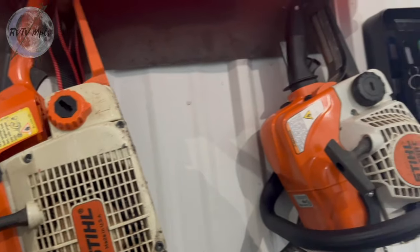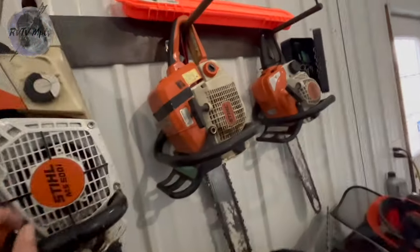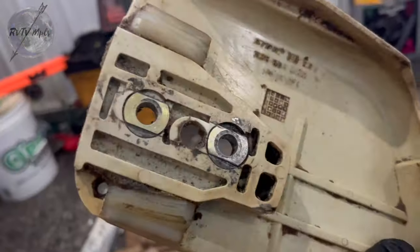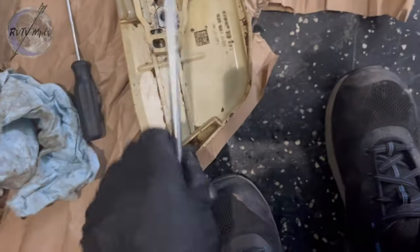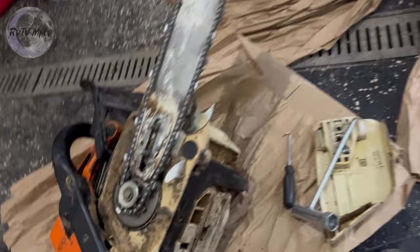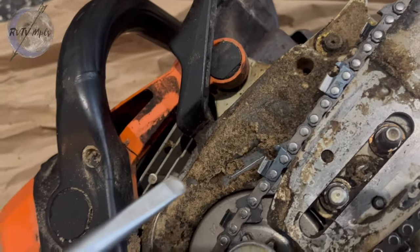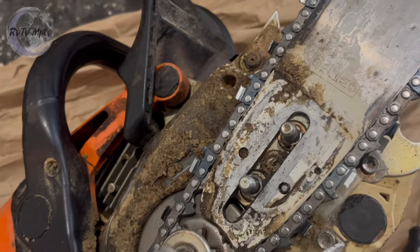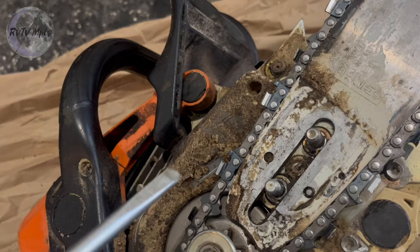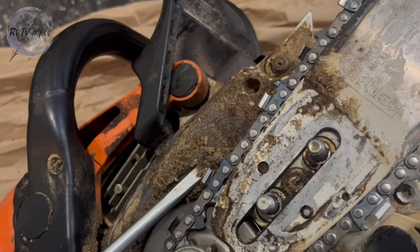These saws haven't been cleaned up in a while, so the first thing I'm going to do is just grab a saw and start cleaning it. I just got this all clean — I take this pick right here, I'm going to keep this, and take this rag. See all the stuff I got out of it — it's a bunch of wood pulp that kind of gets buried in there from use. There's still plenty on the saw here. If you don't clean this up every time you use it, all of the oil passages that oil the chain bits and the gear bits get all clogged up, and you end up burning up a bunch of blades and your saw doesn't run efficiently. So we're going to give this thing a good clean out.